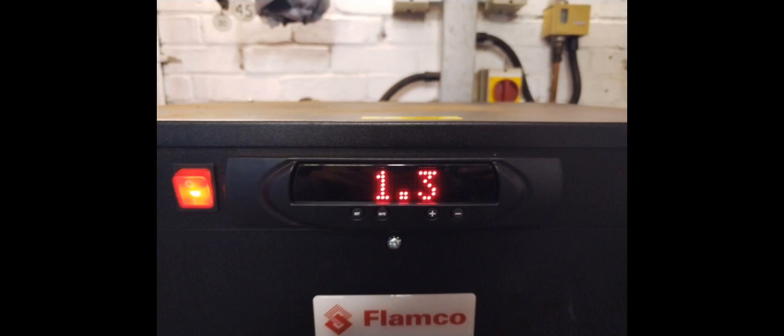This was the temperature when I walked in - no boiler on. Went to the pressurization unit, pressed plus and minus together, put in the typical code 4706, then held down the set button to get one of the pumps going, then held the mute button to get the other pump on - I didn't want to burn the pumps out by running them too long. I just needed things sorted quickly, so I held it down and got the system pressure up. Before that, I went through the settings and told the pressurization unit to be satisfied at 0.8 bar rather than 1 bar, since I found it at 0.9 - just so the boilers wouldn't be held off. You could link out the PU temporarily, but instead I just quickly put in the digits and the boilers were happy.